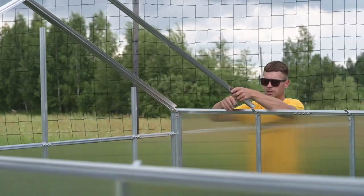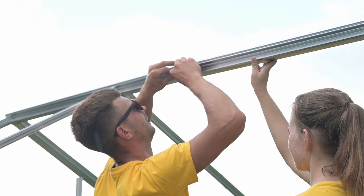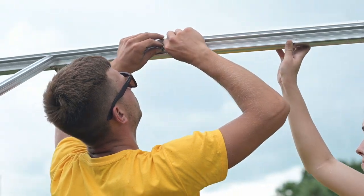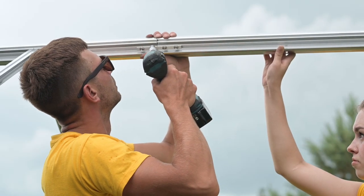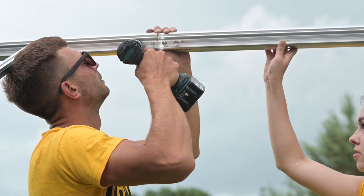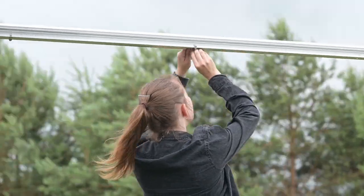After putting the roof structure on the greenhouse, install the inner part of the ridge, connect everything with rhombus screws, and apply silicone to the joints. Install the roof strut fittings on the struts of the front and back wall — a simple screw goes at the bottom and the rhombus screw at the top. Tighten the screws.